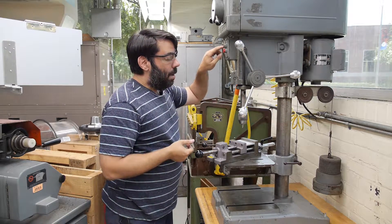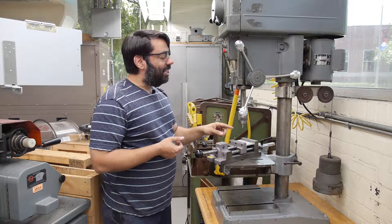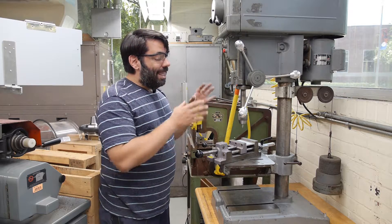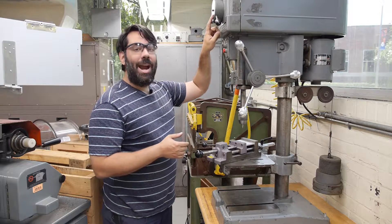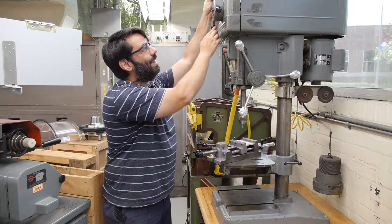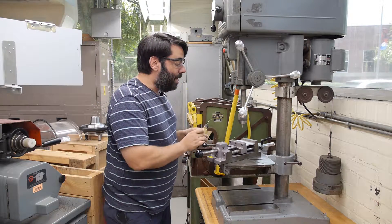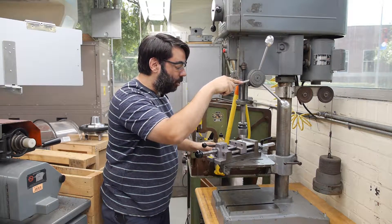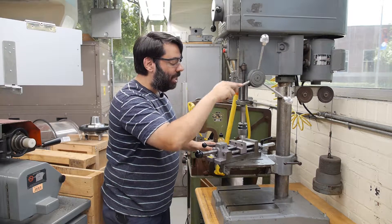I'm going to turn the machine on by pressing the black start button. I'm going to reference the speed chart on the side of the drill press — in this case it tells me, for my center drill, my spindle speed should be approximately 1600 RPM. This drill press works just like the milling machines in that the machine must be running prior to making a speed adjustment. We have the machine running, therefore I can easily adjust this to the 1600 RPM target speed, apply a little oil to my workpiece, bring my drill down to the right location, and commence with the drilling sequence. With the center drill, I'll perform a couple of pecks, and that's all I need with this first tool.